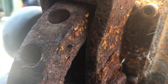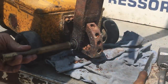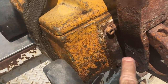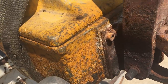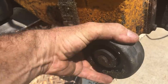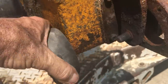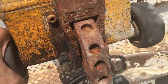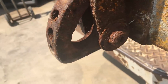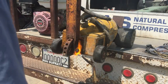As you can see, it definitely sat in mud or something for an awful long time and got frozen solid. I had to heat it up a couple times before I could finally drive the pin out. Sometimes with these kind of jobs you've got to be patient. You can see the rear wheels are locked solid, so at some point when I restore this I'll just cut those wheels off — I don't want to risk cracking or breaking that back aluminum housing.